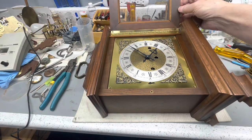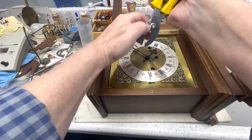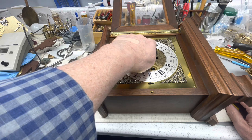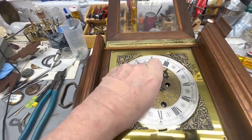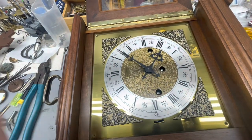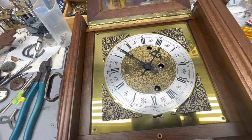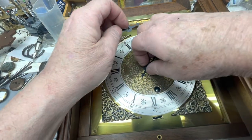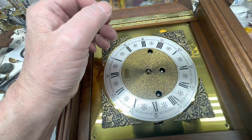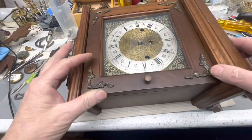This is more or less pretty simple stuff. Take the hand off. Here's another little tip: if you're taking hands off and on these Hermle movements, you might want to consider putting the hand on tight using a pair of pliers at the end, tightening it up — only because I find so many of these where the hand nuts have fallen off.